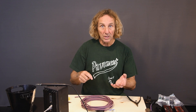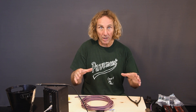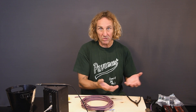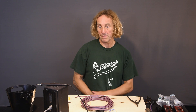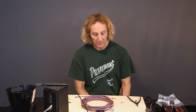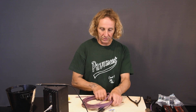Into a DI box, then you bridge with quarter inch cables together four DI boxes and you have the mic level out. For the line level out you could use a bunch of Y cables. You don't really need to isolate all these cameras — they're almost always on battery and you're not worried about ground loops. You just need four shorted-together outputs, but having a professional clean way of doing it is handy.